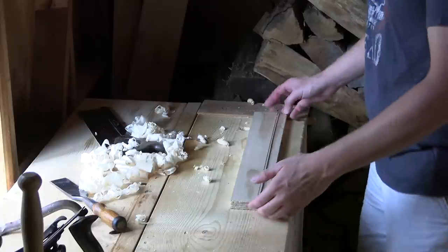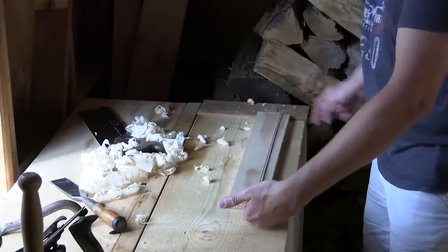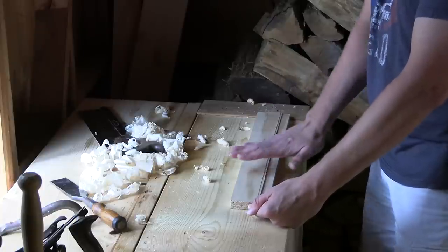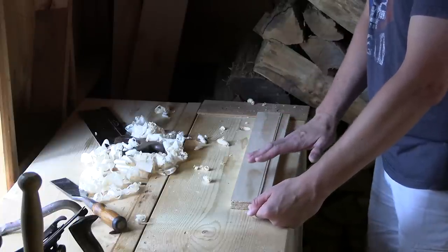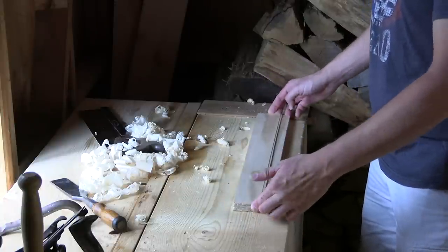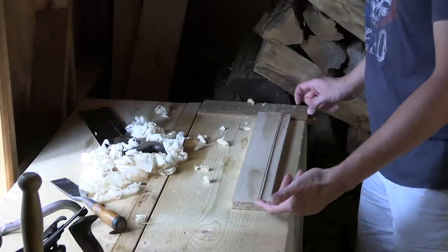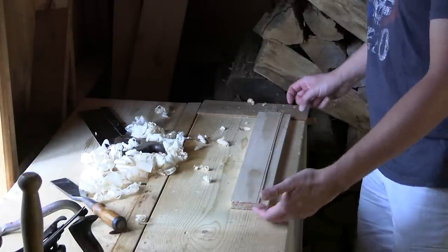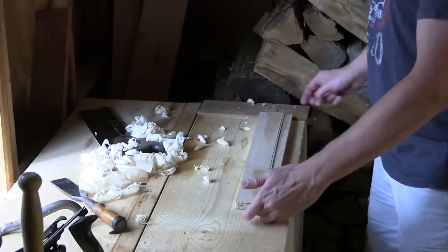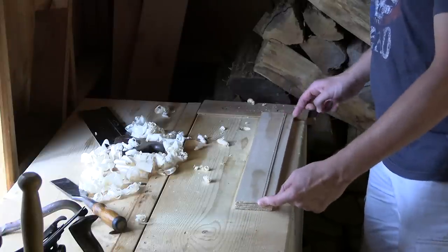a vise. With tail vises or end vises, where you're running up against a dog and the vise is coming in and pressing, you actually can exert a substantial amount of force that will slightly bow the board, and you're planing it flat and you release the tension, the board actually goes out of flat because you had it under compression. So you have to be careful with that. Certainly you can back the compression off the vise, rotate the vise backwards a little bit, but then you have to ask yourself, why do I need that holding it, restraining it in place when all I have to do is resist the direction of force?